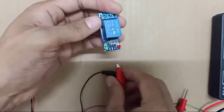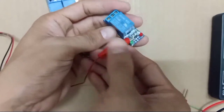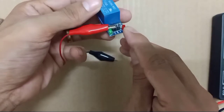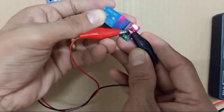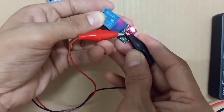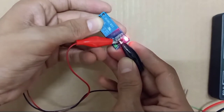Since I already confirmed this is a 5V supply, I want to test VCC for the positive here. It's easy to see there is an LED — this one is a trigger, this one is for power on. You supply ground to the negative. Okay, this relay is powered on, but how about the coil? How are we going to know this coil is in good condition?